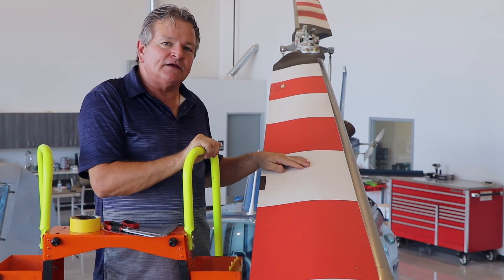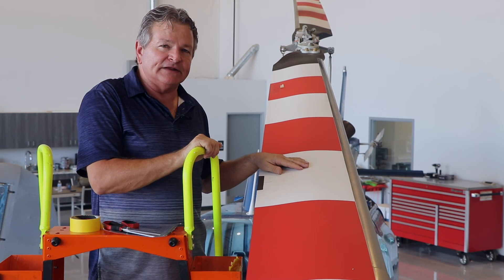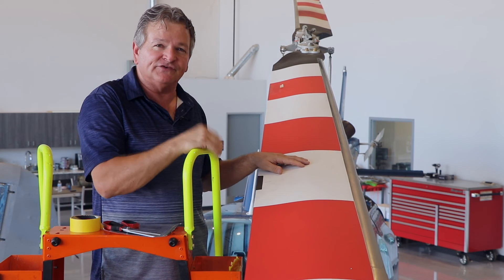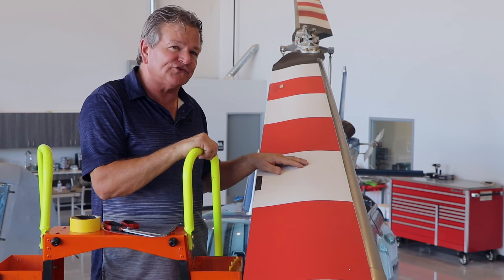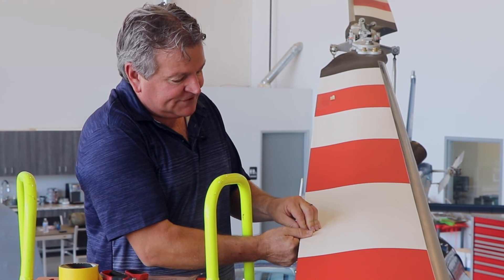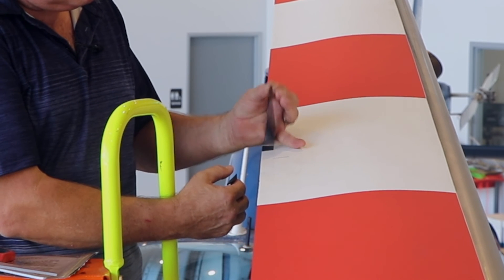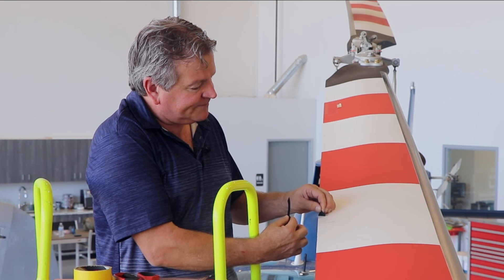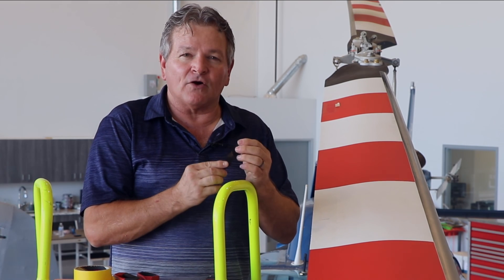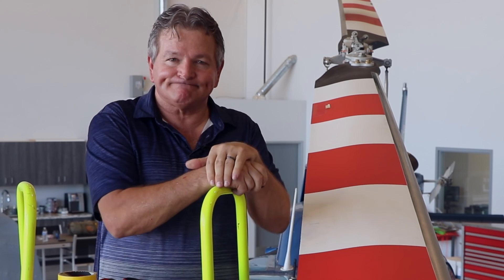If the operator wants to put these blades on another aircraft, what we recommend in the technical bulletin is to zero everything out. You're used to doing that by zeroing the tabs — with wedges, you simply remove them. Just grab the corner of it, peel up slowly, and once you have all of them off, throw them away. They are one-time use only. The rest of the instructions are in the technical bulletin. Happy tracking.